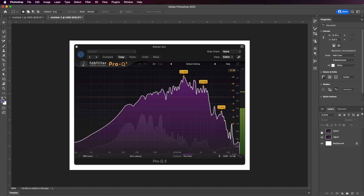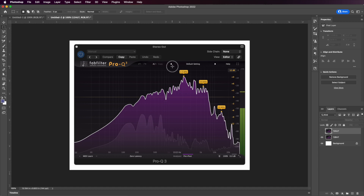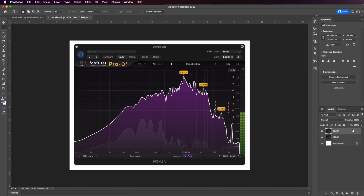In person, you can barely tell the difference. It's interesting on this one that the frequency peaks the EQ picked out are all the same — 2.1, 5.6, and 14K. I thought this was an interesting little experiment. For now, I've got the 12BH7 in my JTM Micro, only because it's technically barely louder. But as far as everything else, I cannot audibly tell the difference in person. Hopefully you found this interesting and maybe helpful if you're trying to decide between a 12BH7 and a 12AU7 for your micro project.